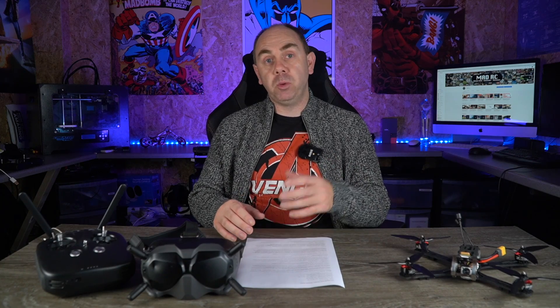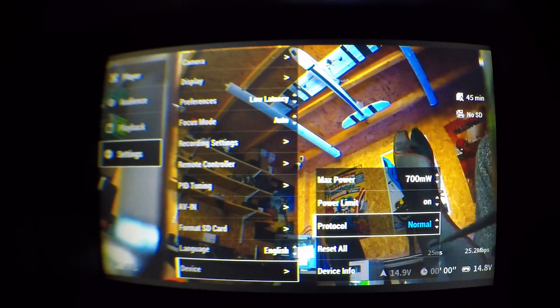A significant change in this firmware is that DJI HDL has been renamed to SBUSFAST. DJI created the protocol and wanted it added to Betaflight as DJI HDL, but there is reluctance within open source software to name features after manufacturers, so Betaflight labelled it SBUSFAST. This was causing confusion because the goggle showed HDL while Betaflight showed SBUSFAST. DJI have now aligned with Betaflight and it will be called SBUSFAST — it's simply a naming change that removes confusion when setting up the system.